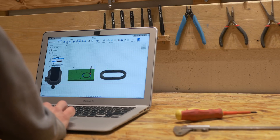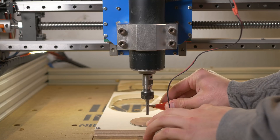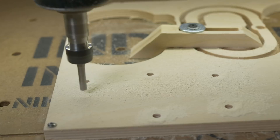The second version was made out of 10mm plywood on the IndyMill with a 6mm straight-cut milling bit. I really like the idea of upgrading a CNC with a CNC, so a dust shoe like this is a perfect first project if you are just starting out.